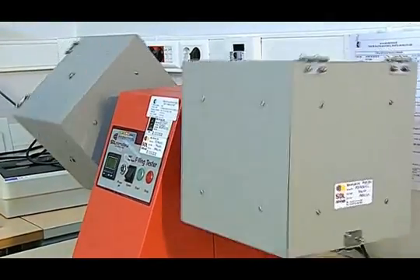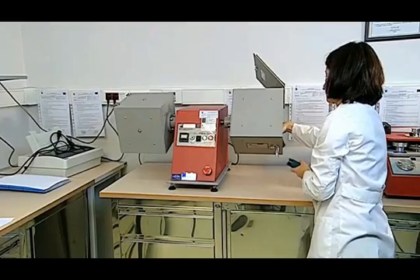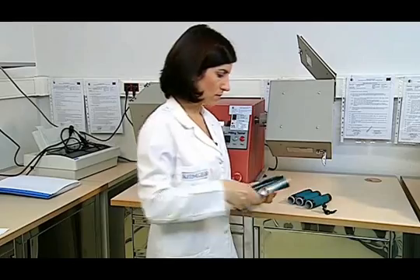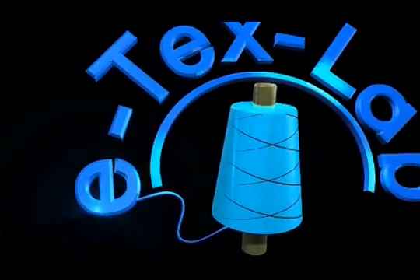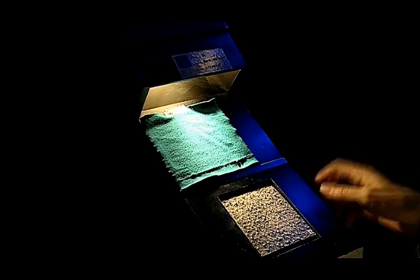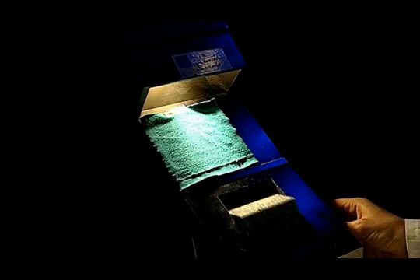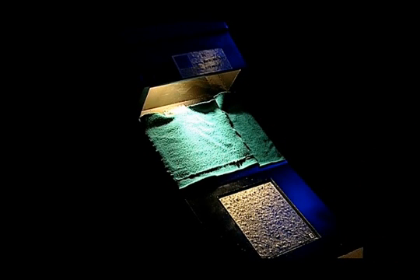After the device has stopped, the test sample is taken out of the device. Unstitching the sample, the pilling and fluffing formed on its surface are analyzed with a FlizzCop testing device in the darkroom. The test sample subjected to a pilling test is placed in the FlizzCop device. Here are photos of the knitted fabric. Photos from one to five are evaluated according to the sample's pilling change. Putting the original sample on the right side, it is rated appropriately.